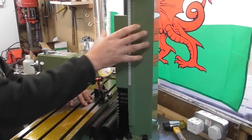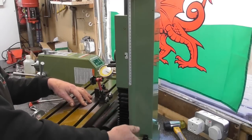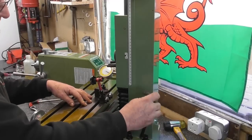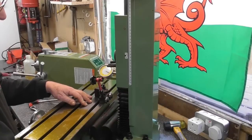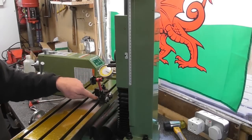I've just put the column back on. I've done exactly the same with the column — removed sharp edges, burrs, giving it a stone over all the sharp edges, the same on the base, cleaned it all up, basically bolted it back on. I've got the 10mm Allen key here and I've just given it a two-fingered nip — I can get a little bit more on there. I've cleaned up a spot on the table and put a DTI clamped on the table with one of my new clamps.